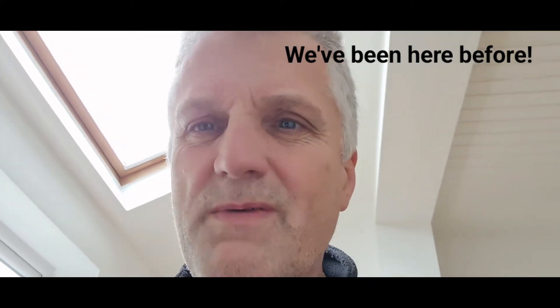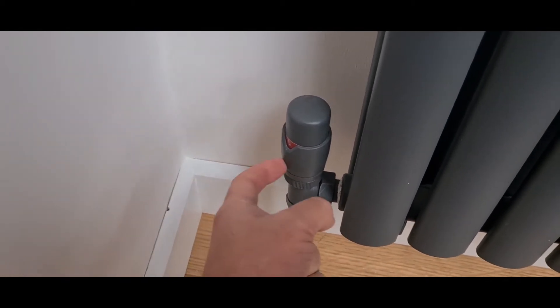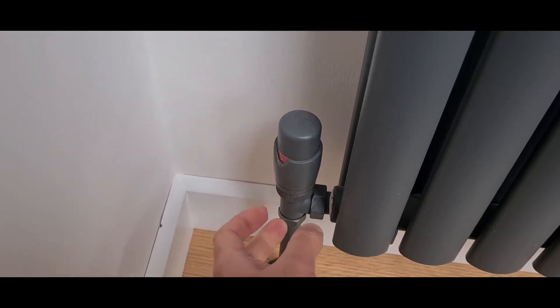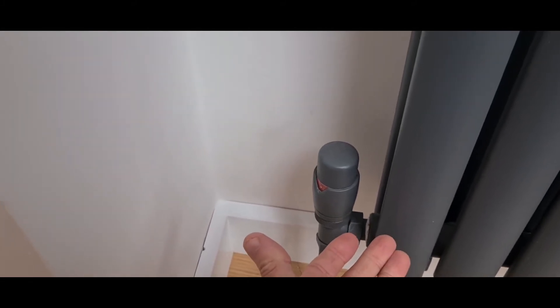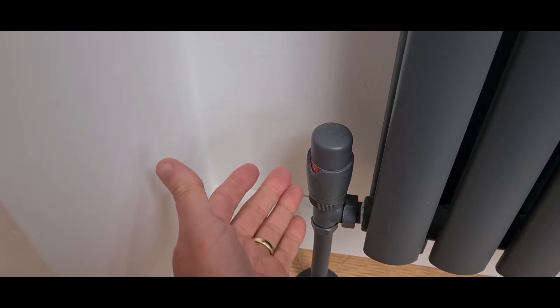Now what are you on about, Steve Dog? You ask — you could just turn that one down a bit. No. That's a thermostatic radiator valve which, when it gets the right heat, will cut out. But I want to slow the flow down so it heats up slightly slower, so that heat will get into other places.